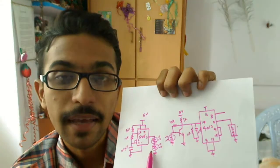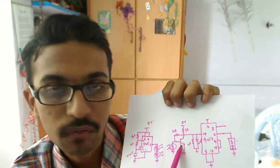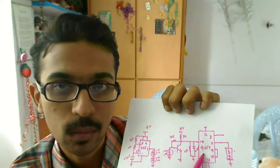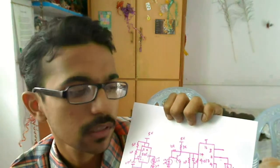In this circuit, the rays from the IR LEDs get reflected from our hand and reach the photodiode. The photodiode switches this transistor on and off, and this transistor gives the clock signal to the CD4017 counter. Depending on the clock, it switches on the load at the second pin or the load at the third pin, alternately.